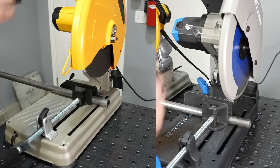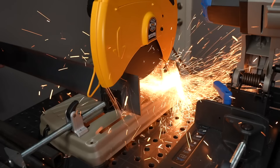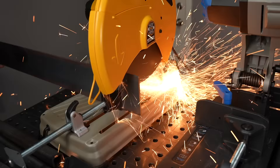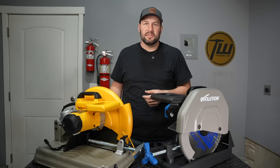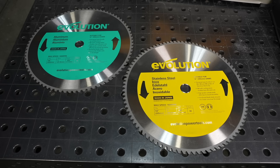What materials can you cut with the different types of saws? Both will cut steel. An abrasive saw — most discs are set to cut steel and stainless steel, most ferrous hard metals — and they do a good job at that, cutting really hard materials. However, most discs for abrasive saws aren't set up to cut aluminum or other soft metals, as those can gum up on the disc and keep it from cutting.